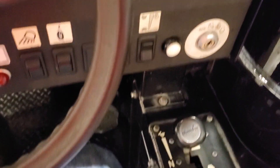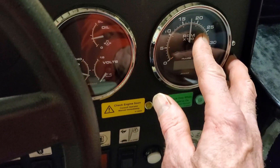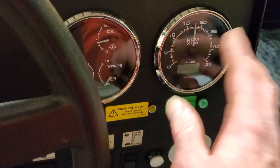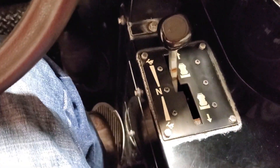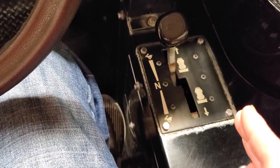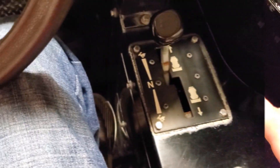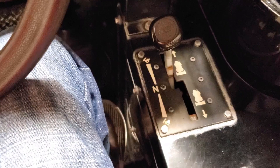To wrap everything up: I set engine speed to about 2500 RPMs for ice resurfacing, 2000 for floods or moving the machine around, and just over 1500 for idling. For the transmission lever, I set it so my foot's all the way down when making passes up the center of the ice. When turning for corners, I back off the pedal, then coming out of the turn, I put it all the way down. This way I'm going up the center at the same speed, laying the same amount of water and taking up the same amount of ice.